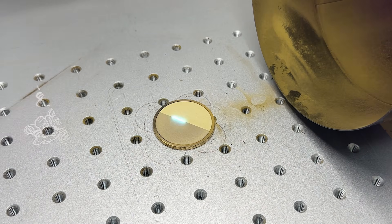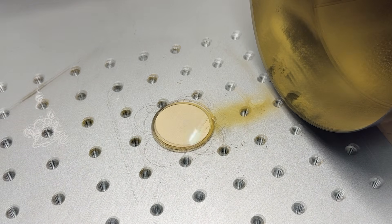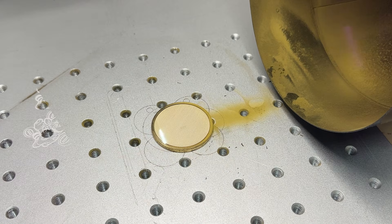At this point, a lot of people would assume something's wrong with the laser or the file settings, but it isn't. Lightburn is doing everything you told it to. Everything up to this point is just top level layers being removed evenly. Here's the important part: it took 48 layers engraved before the top of the image started to reveal itself. You can see that little piece right there on the camera — I'll circle it. And that lines up perfectly to what she was seeing.